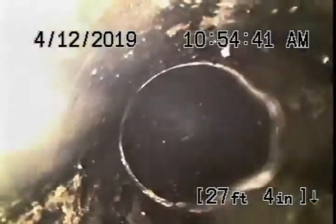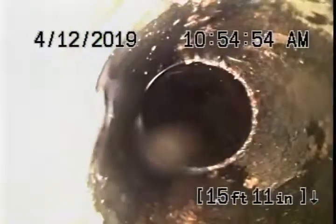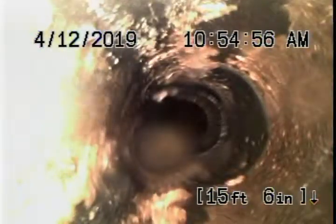Now we're running the camera from the other side. Just cleaning up the lens a little. This is outside of the building — there's the clean-out, and we're going to come underneath the house. We wanted to check the main line. It looks like ABS plastic underneath the house over here. Of course you'll have the general inspector check everything underneath. This looks okay over here.